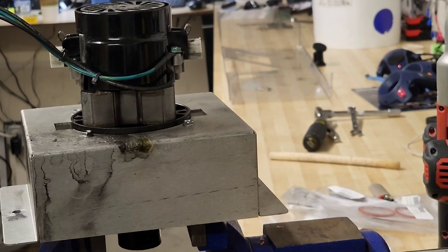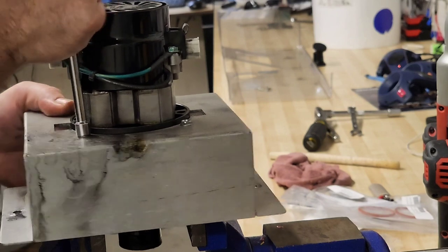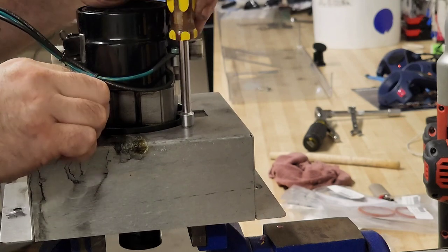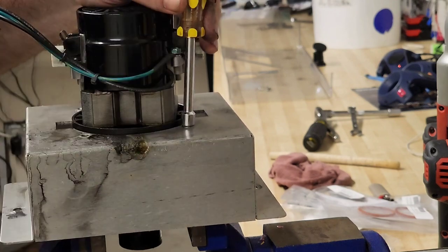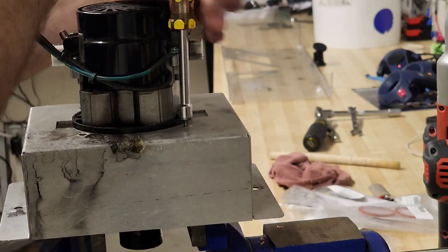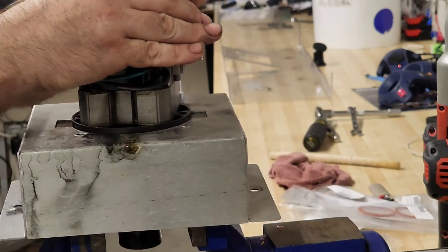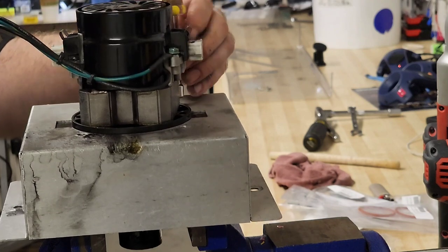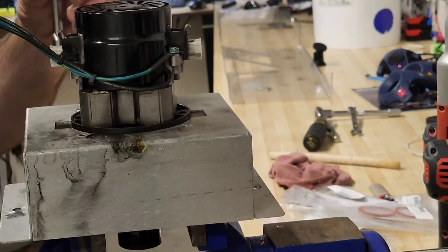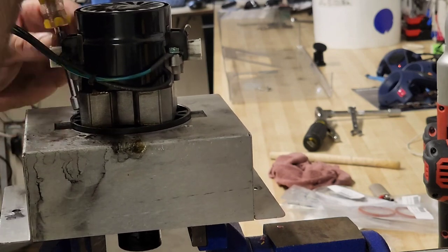So the question that I have at this point is, how far down the rabbit hole do we go? What I'm gonna do, if we have time, I think we do now. It's about 1 o'clock. They don't need the lane machine back until closer to 5. We're gonna take the vacuum motor apart from the vacuum motor's housing. We're going to clean the felt on the inside. We're going to clean the exterior of this.